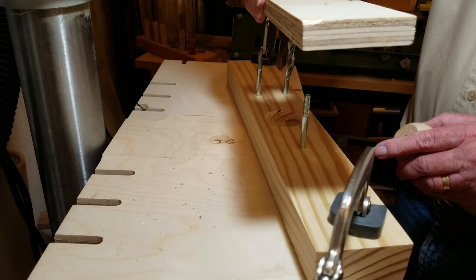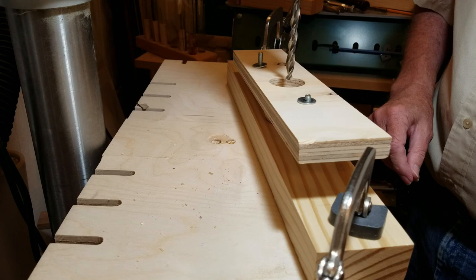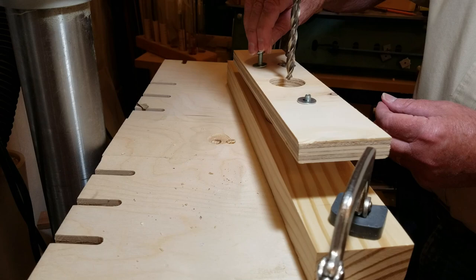A two-inch ball was placed into the hole in the base and the top was mounted. Since the balls I purchased had a three-sixteenths inch hole in them I turned this hole up and aligned it with the drill bit. Thumb nuts were used to tighten the top to the base which secured the ball in place for drilling.